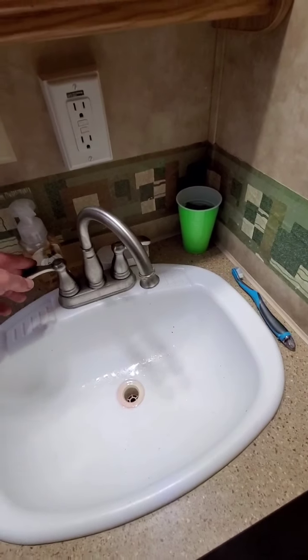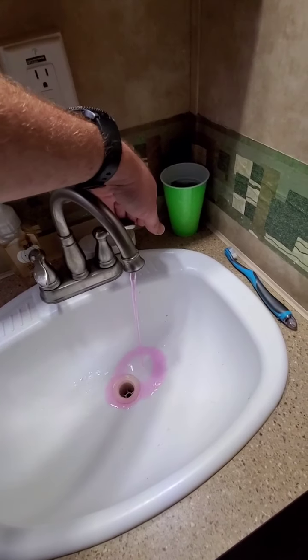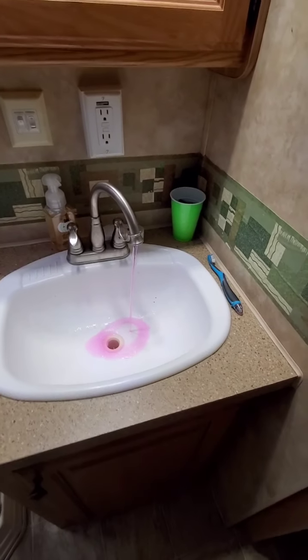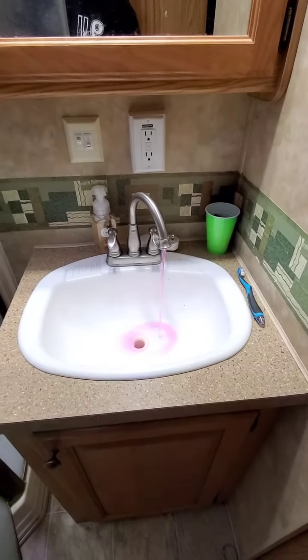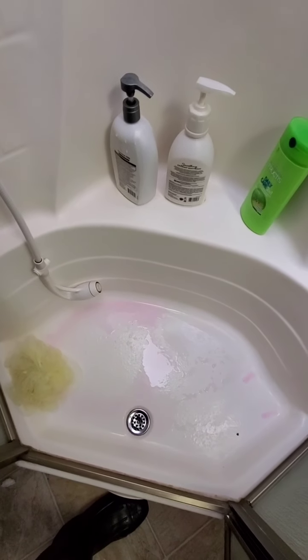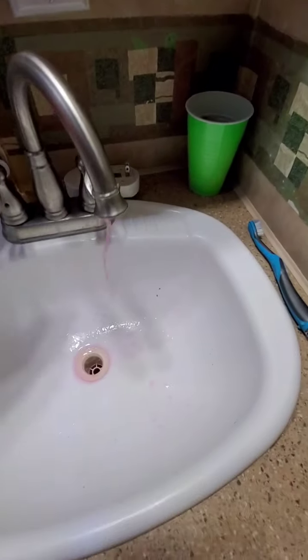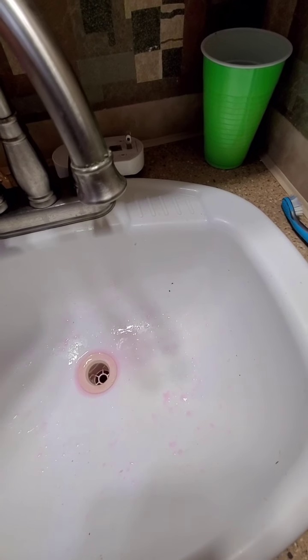Alright, so now we have a dry pump running, and I'm just opening my valves to let out any of the residual, which is also going to help fill the drains. And again, you don't have to have everything filled up. All those pipes don't have to be filled up with antifreeze all winter. A little easier to clean out. And you'll hear it blow some air.